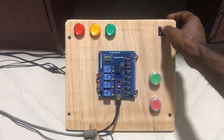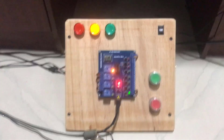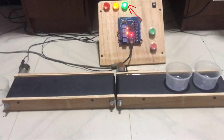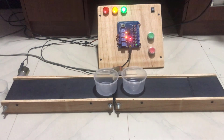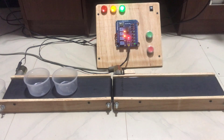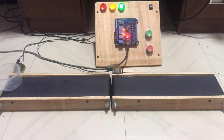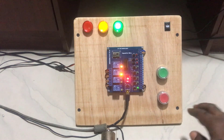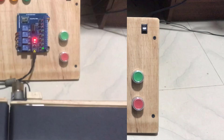Now we move to test the board. We turn it on — we can see it on. I press the start push button and we can see the yellow light coming on and then the first conveyor running. We need to wait — the first conveyor is still running, and we can see the second conveyor coming in, moving material from one point to the other. Working perfectly. Now we press the stop push button to stop the whole system — and that is perfectly done.